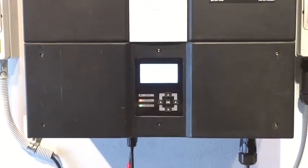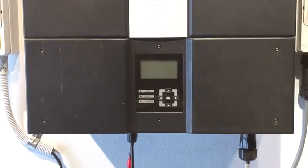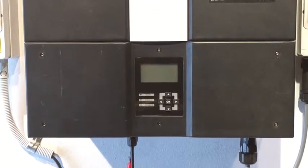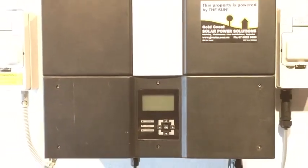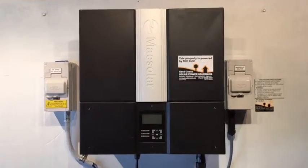We want those lights to go off — we want all the power to be drained from the inverter before we try giving it a proper reboot. A bit like your computer, you should leave that for about 30 seconds or so before rebooting it. Now with the Max Solar Inverters, unfortunately the Max Solar company has actually disappeared — they're no longer around — and what that unfortunately means is your warranty is not worth the paperwork it was written on.